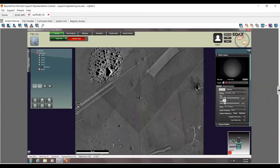So if I increase my gain, we will see it go up, and at some point I will actually saturate. You can see that at this point here, probably around 50 or so, I'm going to saturate at around 1. And of course it doesn't go above a value of 1, just more and more pixels get saturated. Now for the highest quality data, you want this to be around 0.8. Why? It's kind of arbitrary, but the issue is that with some orientations and some samples, like a multi-phase sample, you'll have 20% variance on this. So it'll go above 100%, you'll have it maxed out.